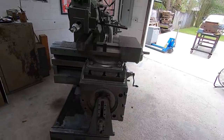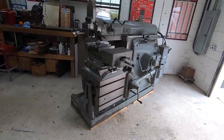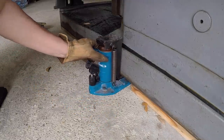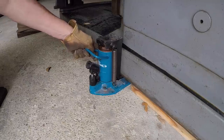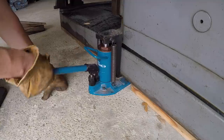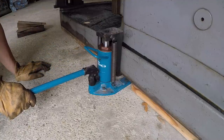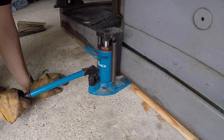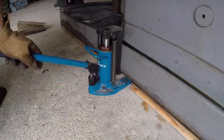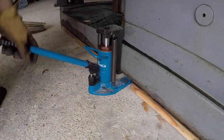For what we're doing, we don't really need to do that. So I got a little toe jack that I bought back when I got the shaper - just a little cheap import tool that I got off eBay. I think they're around 125 to 150 bucks. Well worth the investment to have around here if you're picking these heavy machines up. So the plan is to tilt it up on this side here using the toe jack, with boards cut out in the middle to clear it, and then see if I can slide that 2x10 out from underneath it. I've also got some wooden wedges that I'll put underneath there to kind of keep it up.